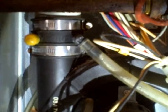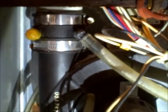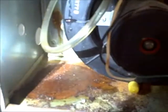That fitting itself is the one with the steel bands and the yellow cap — it's leaking right at the top edge there. Matter of fact, it just dripped. Also, the motor itself is kind of whining, which is usually an indication of wear and tear. The condensation has dripped and you can see the base of the furnace — all the rust stains — so this has been leaking for a while.